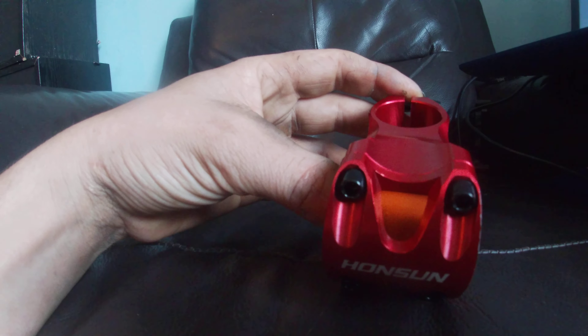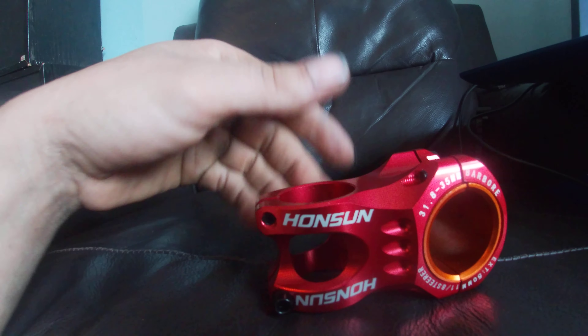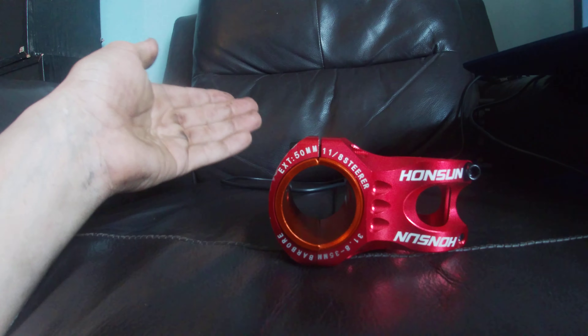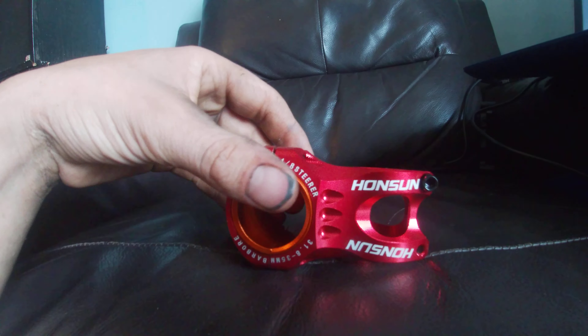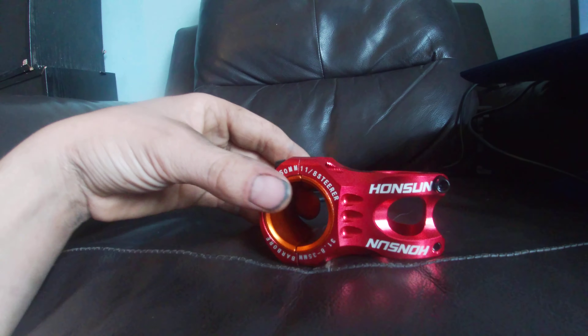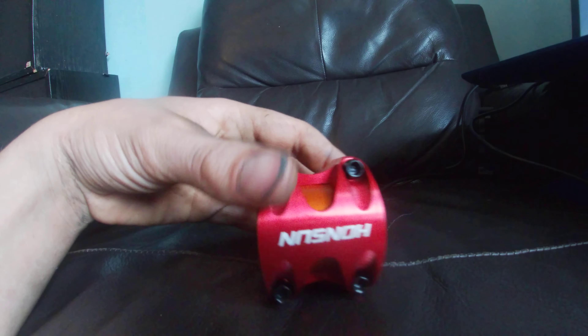There's no porosity in it like the Wake stem — some of those I've seen are absolutely horrible. There's one we're going to have a look at in a minute called the Astro, which is essentially a Wake stem but even worse. Anyway, I digress — the machining on here all looks reasonable, it's all clean, there are no nasty sharp edges or any cheapness like that. All the anodizing has covered the whole stem, which is a thing — sometimes you get stems where the anodizing doesn't cover the whole thing, which is a sure sign it's terrible.